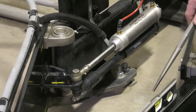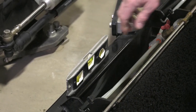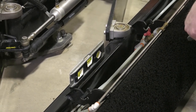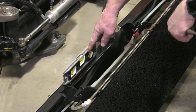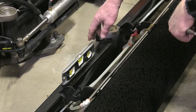This one is really important: we have a level sitting right here on the framework of the equipment. In order for the product to maintain even distribution, the manifolds themselves have to be absolutely level. So we have to check and make sure that the framework itself is level — when it's level, we get even distribution, which results in high quality tires.